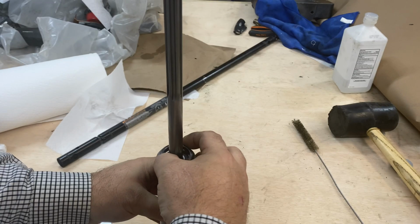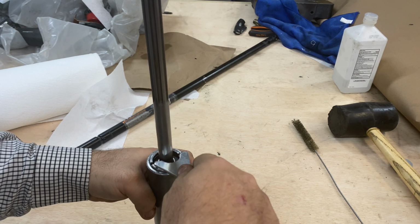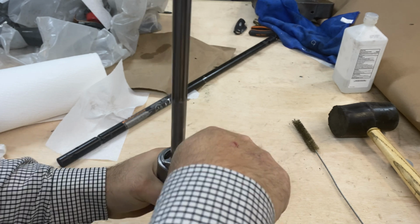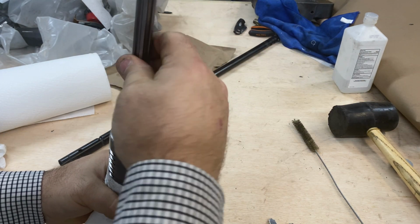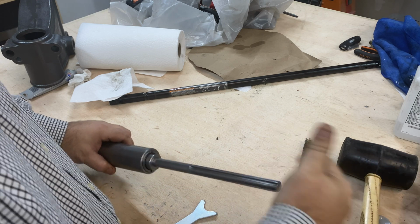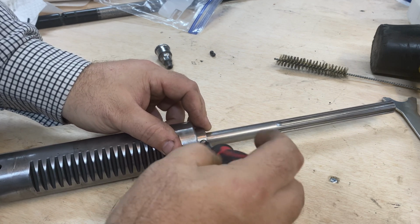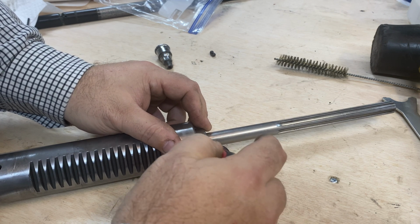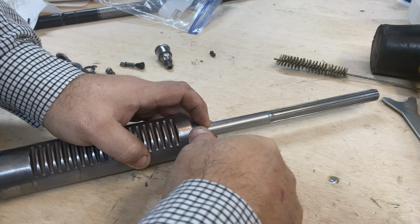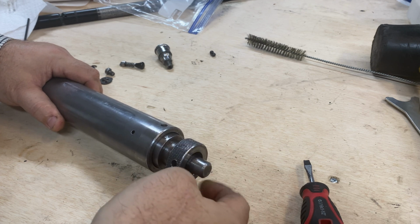This is the bearing locking nut. Turns out that a handheld grinder's tool works just perfect. It has this perfect spacing for the slots in this nut. Checking to see if the spindle spins. Now I'm just going to put the collar on. Make sure it's locked down. And to finish it off with the chuck release.